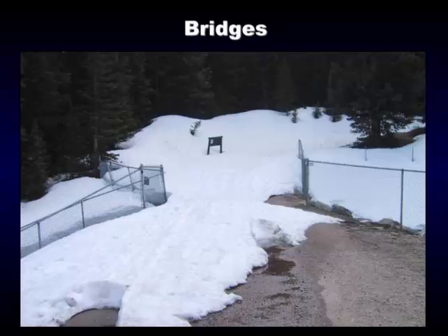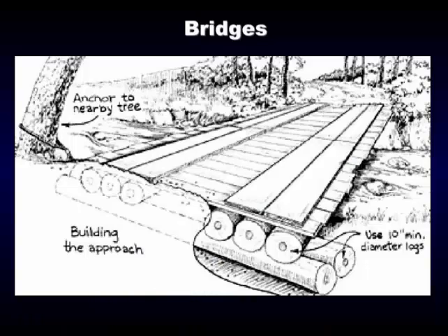This is a bridge crossing — we were getting ready to have a small timber sale over here, about five loads. Somebody had not done the engineering homework on this little bridge — it had not been designed for 80,000-pound loads. We came across it and cracked it with just those few loads of logs. It now has a different bridge in there. We broke it — didn't fall through — but it cracked. Make sure the bridge is going to carry what you're taking out before you start across it.